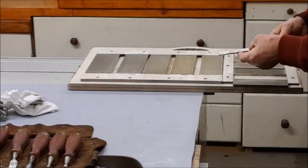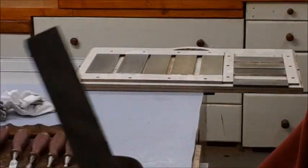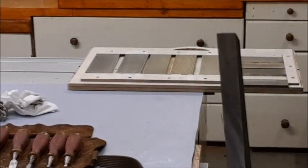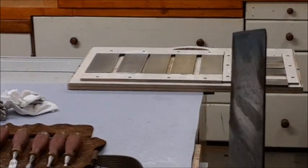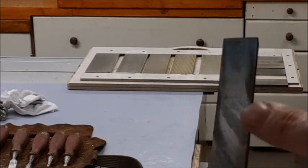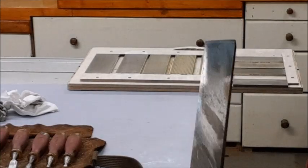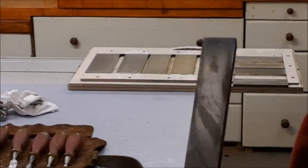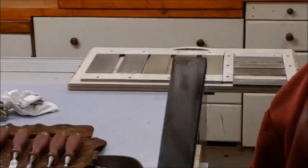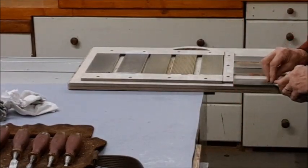Let's have a look. Now I don't know if the light is going to show you there — but you can see that the edges have been caught up on the two sides by the stone, but the middle is not. Which means that back is dished. That's no good. We need that flat. So you keep working this until it is flat.